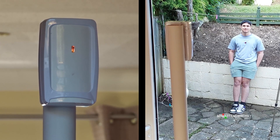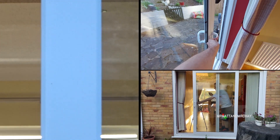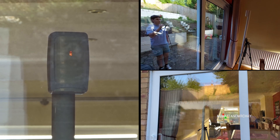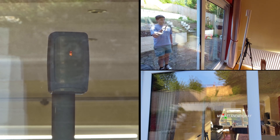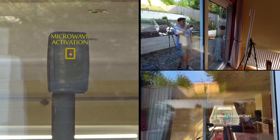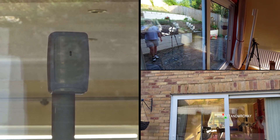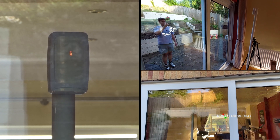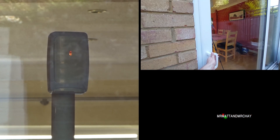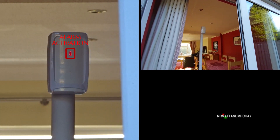Here is a quick demonstration showing how a microwave can detect through glass. Once the unit is obstructed by glass, the PIR monitors the energy level of the glass itself and clears. The microwave, however, if not adjusted correctly, can penetrate the glass and detect motion on the other side. Note that this is a triple glazed door — if this had been plasterboard, the microwave would hardly notice it's there. With only the microwave activating, the dual-tech cannot produce an alarm.